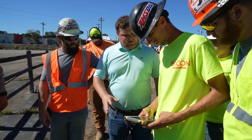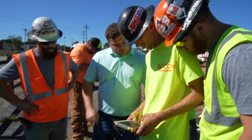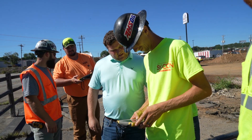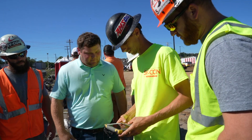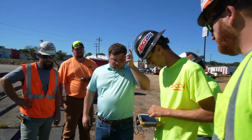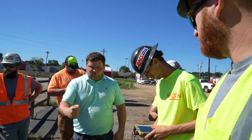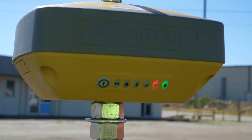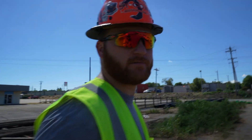We've got the proxy file in here, so we go to setup and set up our GPS base station. We're treating this as an unknown point — acting like we're starting from scratch. You name it 'base' or whatever you want. What 'add point to project' does is put it in our control file, so if we have to reset it, it'll be in the known control point as 'base.' Our connection is through Bluetooth, so we hit next. For an unknown point we'll always run zero for height — that way if you call, I know it's zero. If it's over a known control point you give it its true height. The Bluetooth light will go solid, and that means we've actually got connection.